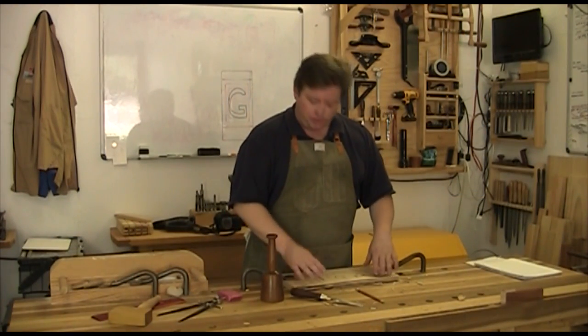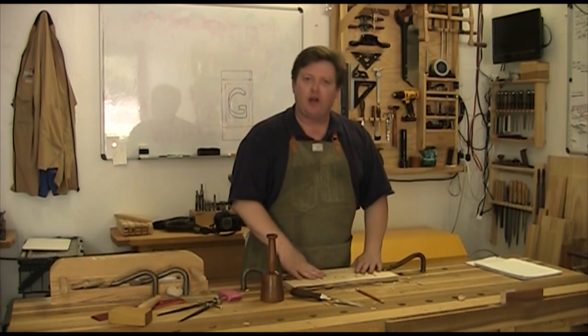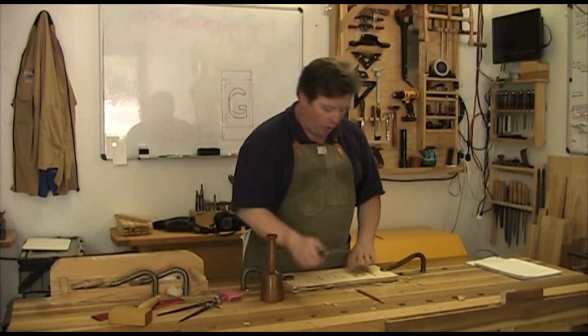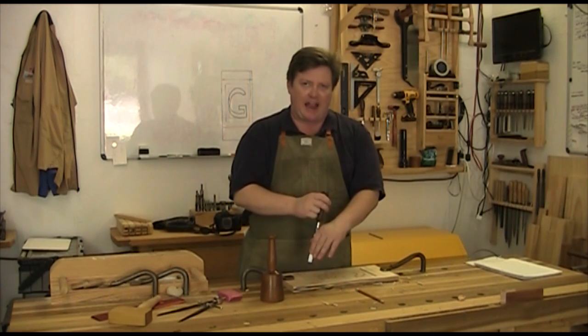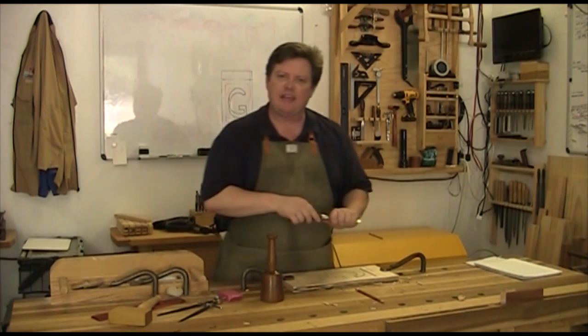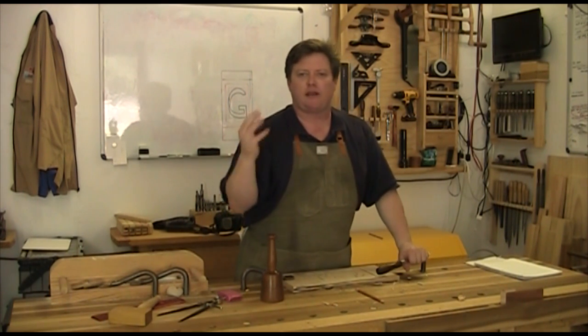Okay, now that you have a small V outlining the frame and your letter, I want you to repeat the process all over again. Go ahead and chop your frame, going across the front, the sides. Chop the letter all over again, and then do these V cuts, because we want it to go about 1/4 of an inch in to give you a good 3D effect.